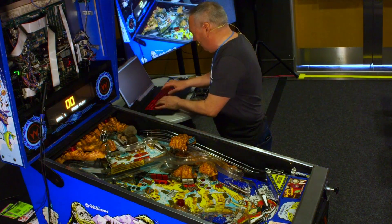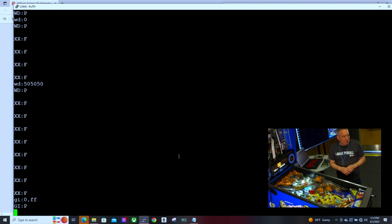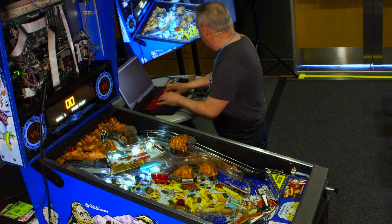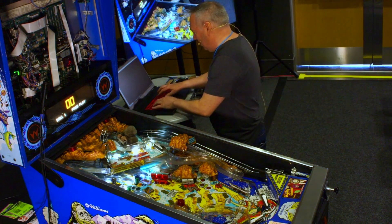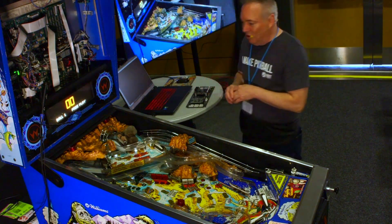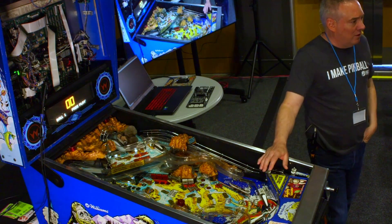The command for GI has five circuits in the system and I can tell it what value to go to. Hopefully the upper portion of the play field you can kind of see it on camera. We can get down really low — this machine has a lot of LEDs and to me they're always pretty obnoxious by how bright they are compared to incandescent lamps. So we now have the ability to turn those way down. They're still glowing — probably a little too much if you're playing — but for special effects when writing code against this, you could do all of that.